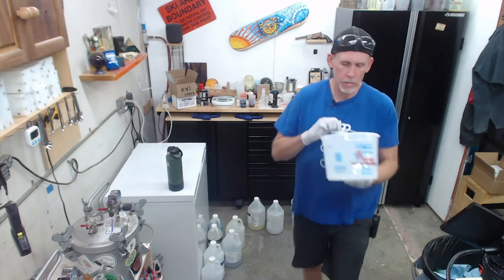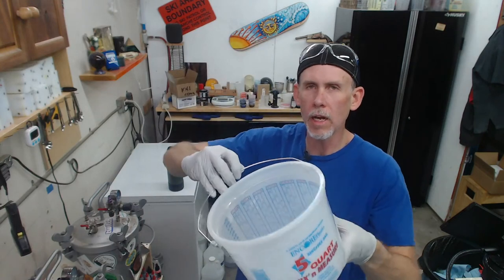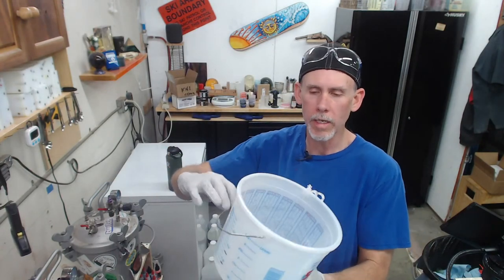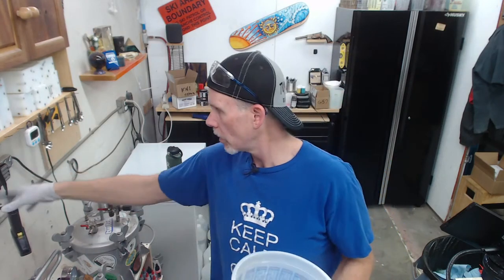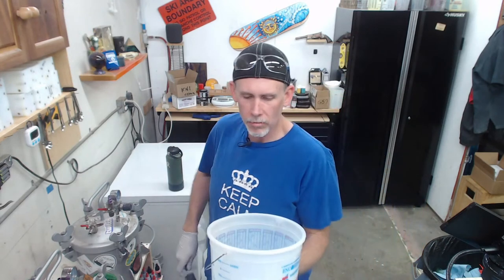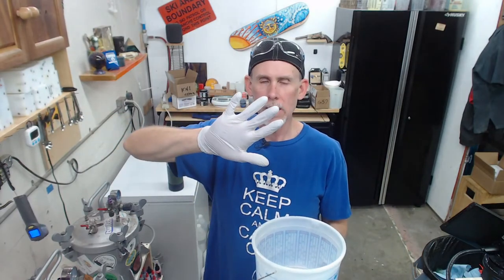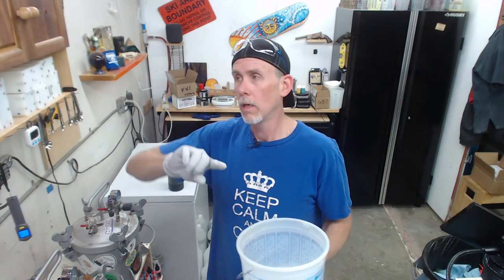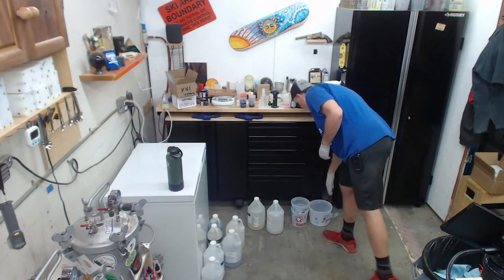I want to look at something real quick. So this stuff still hasn't set up. This is that extra. I don't want to mess with it right now, but it still hasn't set up. So that'll give you an idea of the gel period. This was not as hot as those cups, though. It was significantly lower, but I'm kind of curious what this thing is reading now. 112. So this is actually getting to the point where, with the Amazing Clearcast, it started to get thinner in viscosity when it hit like 105 to 110, and then it started thickening back up when it hit like 120. So it's kind of an interesting thing.